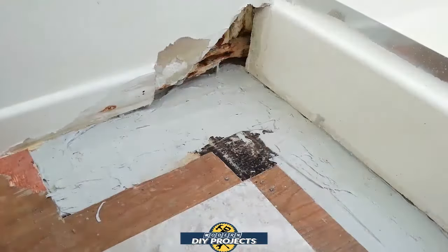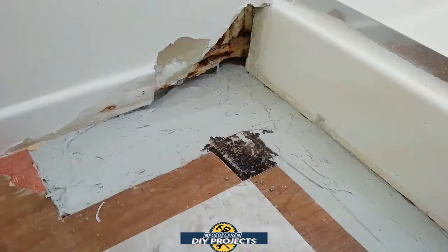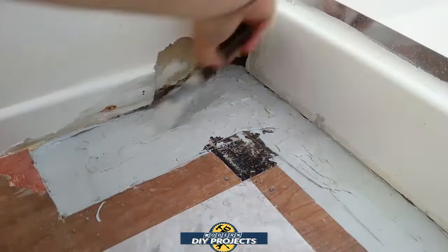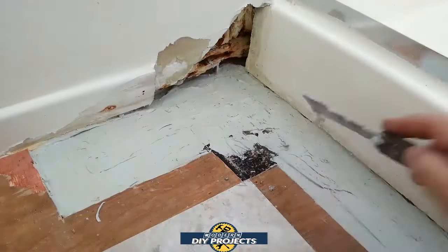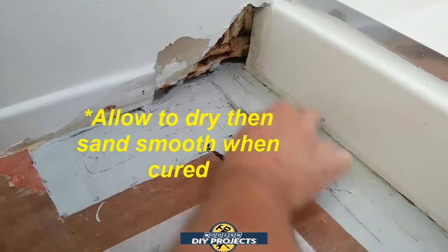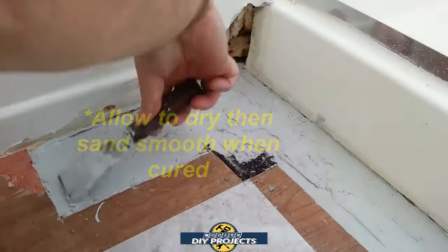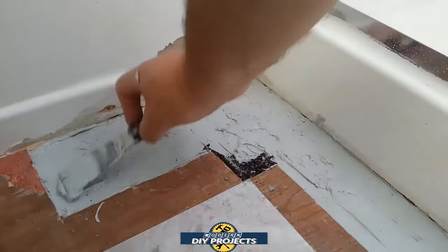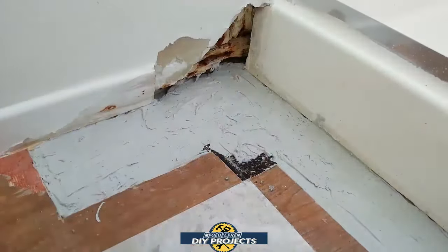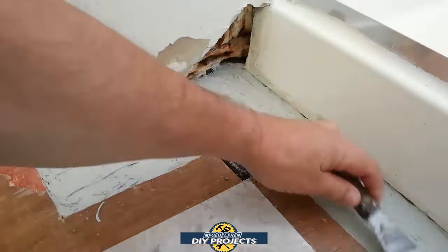Then I just have to cover it up with this one-eighth inch piece of plywood in the corner, because I didn't want to put my new flooring on top of that black tar when I redid this restroom a few years ago. So that's why I put down this laminate flooring, which is only about an eighth of an inch thick, and then on top of that I put down the tiles for the finished flooring. So all I need to do is fix the plywood damage, put new flooring on top of that, then put the tiles on top, and this area should be mostly fixed. Once this dries I'll sand it smooth and put a new piece of plywood right on top.